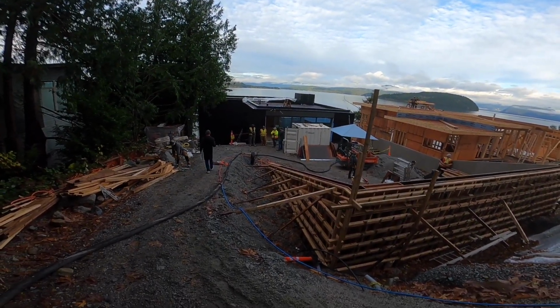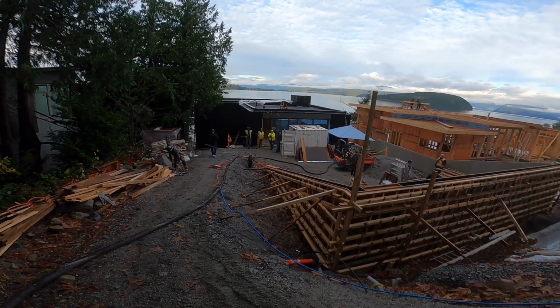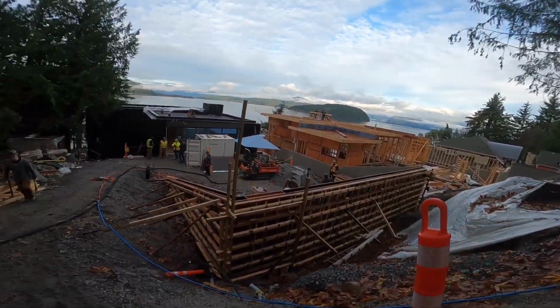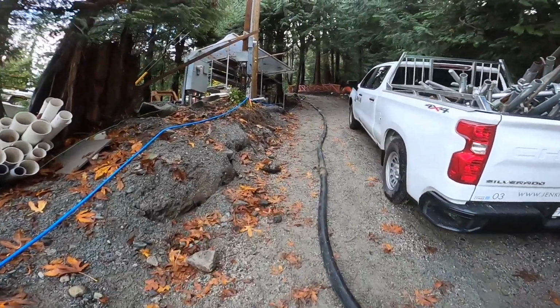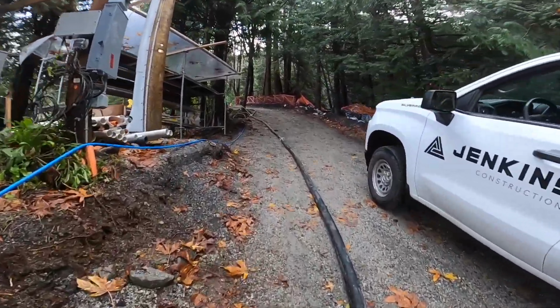And like I said, there still is a very good chance we'll have a little plug at the reducer from 2.5 to 2 inch. If we ran all 2.5 inch hose here, I wouldn't be worried about a plug whatsoever, but decent chance it'll plug there. If it doesn't, consider that a bonus. So we'll climb back up to the pump here. We'll talk about what primer we have elected to use here today.